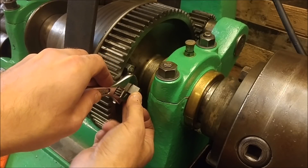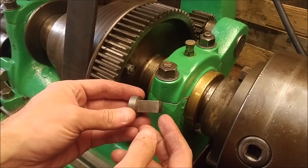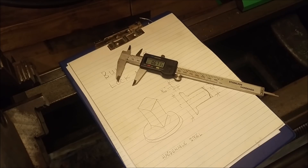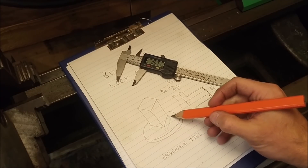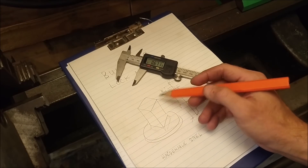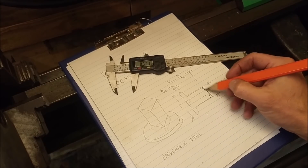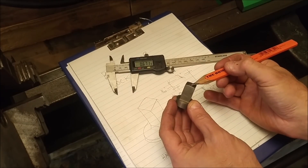Maybe remove about 3/8 of an inch or half an inch from the length of this piece. Unfortunately, the sample that I made — the hole went too far in order for that to happen — so I'm going to make a new one and refine and improve on this design. I'd like to have a radius corner here just for looks. It's a fairly complex little joint but I'll just do that work by hand. I don't have any mechanized tool to do these flats, so I'm going to do that all by hand and use the lathe for the circular components. I also like to bevel the top off, and I've done that on the sample piece — add a little bit of a radius almost to the top there as a nice little detail.